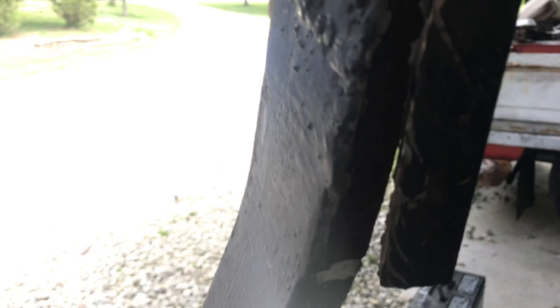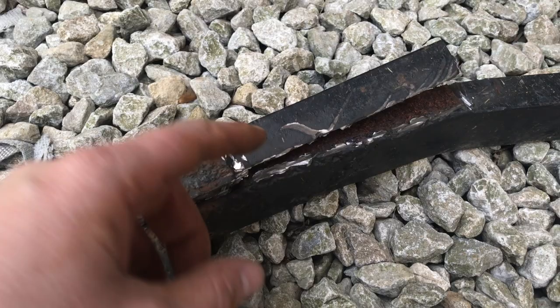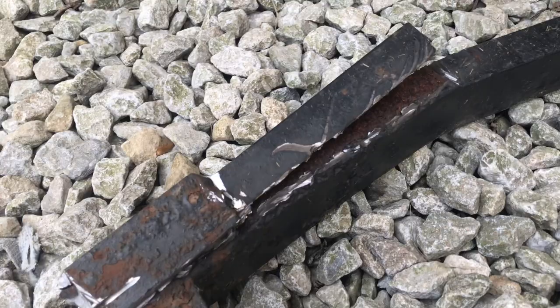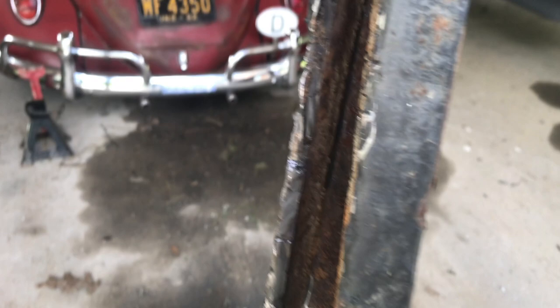I got into it a little bit right there but I think I can get that out. Right now what I'm trying to do is just bend it back and forth — I cut into this weld, got all the way through on the other side, then just kind of weakened it on this side and wedged in this quarter-inch steel piece trying to drive it out. I weakened it to the point I could get a pretty good-sized screwdriver in there, got that split opened up, then used the quarter inch as a pry bar. We've pried off most of it — just got to get the rest off and jump to the other side.